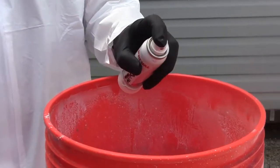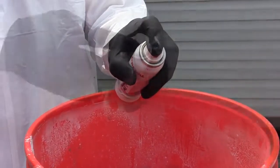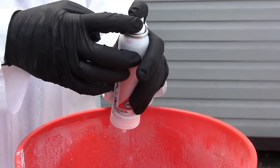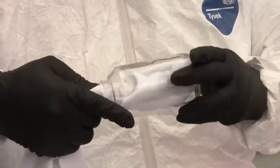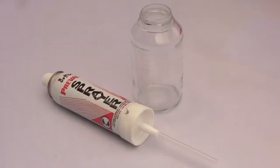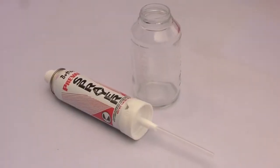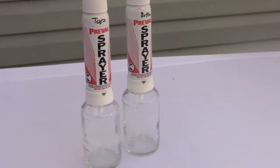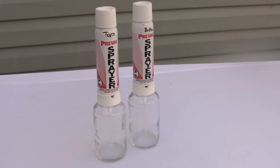Spray the nozzle into a waste container and then, again covering the nozzle hole with your finger, reverse spray the power unit over the waste container. Wipe down any excess bottom coat off of the inside and outside of the glass jar. The unit can now be stored until its next use. Failure to clean the unit immediately after use may result in premature clogging and failure of the sprayer power unit.